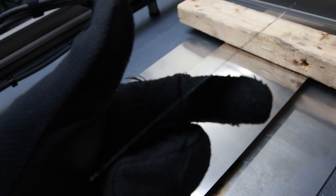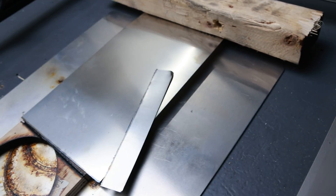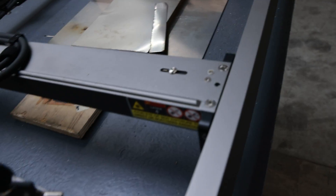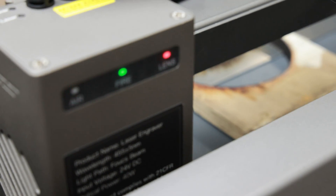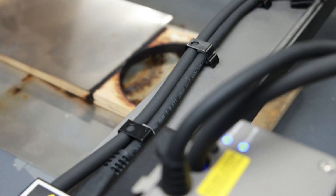I don't really think this compares to the water jet because the water jet is super smooth, but I guess it cuts it. Big price difference though — the water jet is like thirty thousand dollars, this is sixteen hundred to thirteen hundred. After trying to cut that stainless steel it's giving me some alarms — one of them is 'lens,' which I'm assuming means the lens is dirty, maybe because the wood was burning up. I'll clean the lens and then I'm going to try to make the butterfly.